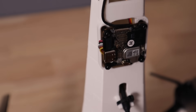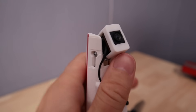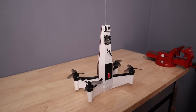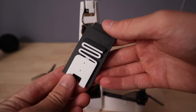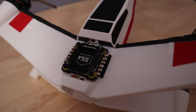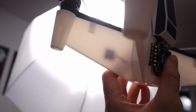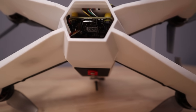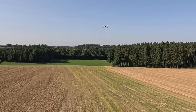I designed a camera tilt mechanism that helps me start and land the drone — it tilts the camera 90 degrees to the front so I can see where I am during takeoff. I also designed a battery compartment with a 3D printed latch and spring so I can put the battery inside and snap the latch into place. The ESC is mounted on top where R2D2 normally sits so it gets cooled by airflow, and I included a GPS unit to track speed. The flight controller is stored in the back, nice and safe.